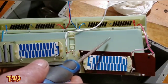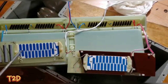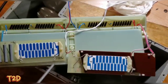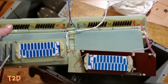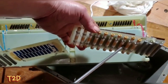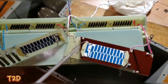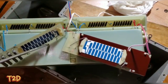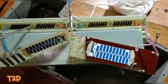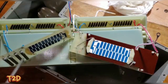We have a string of diodes, a string of diodes, a cap and a cap - that's one voltage doubler - then the same again for the other side. This is a bipolar supply, so we have a plus and minus supply referenced to ground. These are high-value resistors to sense the voltage, and on the back are compensation capacitors to knock off the high frequency and give a smooth DC for monitoring. Overall it's a full-wave rectifier made up of two voltage doublers.